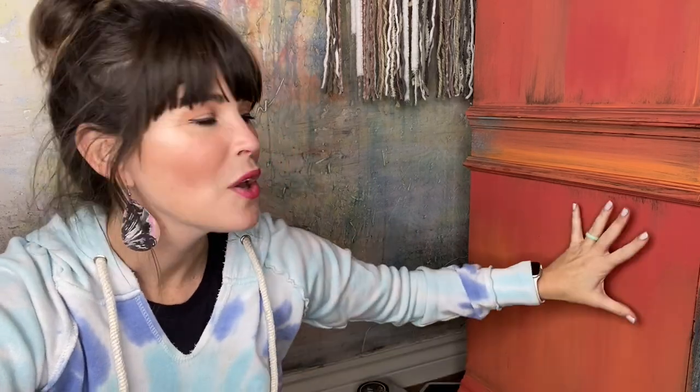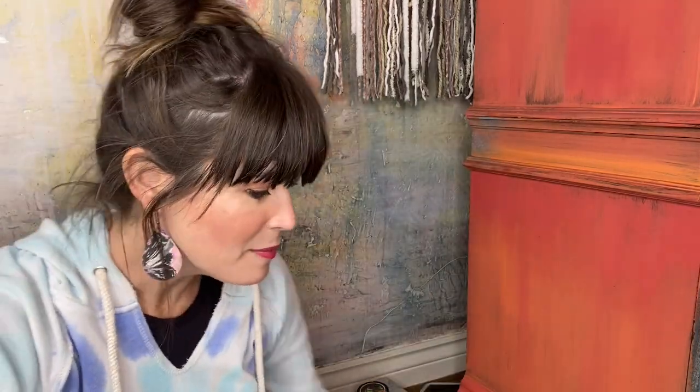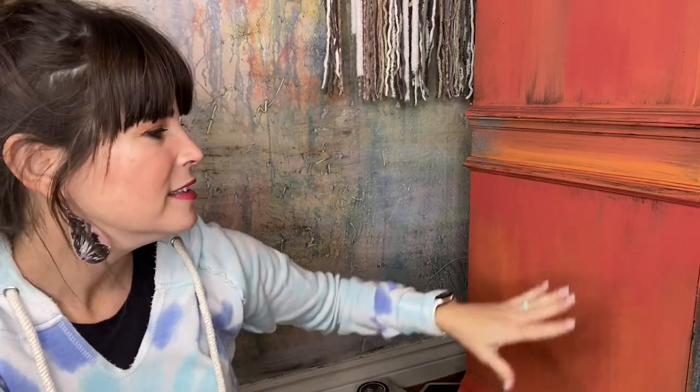Hey guys, I wanted to show you a step-by-step process of how I achieved this look I'm calling Baja Kisses, and how I can achieve the exact same look on the side of the armoire. I laid down my base coat of Carnival Red, mixed with a bright powder pigment for intensity. I use all DIY clay-based paint. I also added Fire Starter, which is our bright orange, applied half and half on my brush, lightly misted the piece, and applied the paint in a thin coat. Now I'm going to bring in my turquoise shades: Old 57, Mermaid Tail, and my deeper color, Bohemian Blue.